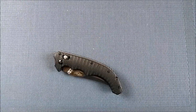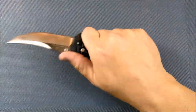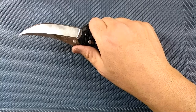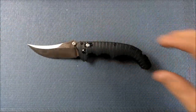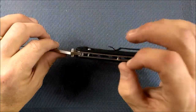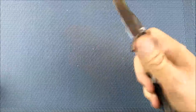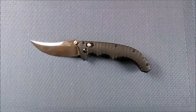I was watching a video last year, and there's this custom knife maker who makes folders — his lowest price knife is $5,000. Guess what he uses for his washers on almost all of his knives? Yes, he uses white nylon washers. That's because it's a really slippery compound — a plastic of sorts, it's nylon. And if you have your pivot set just right, white nylon washers — or black ones, or Teflon washers — they are good washers. There's just this popular hatred of washers made of anything other than bronze in the knife community.